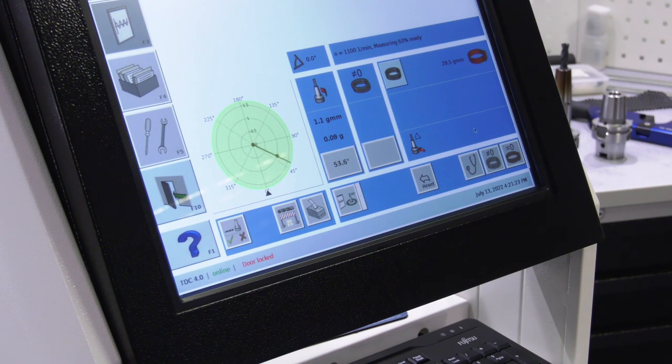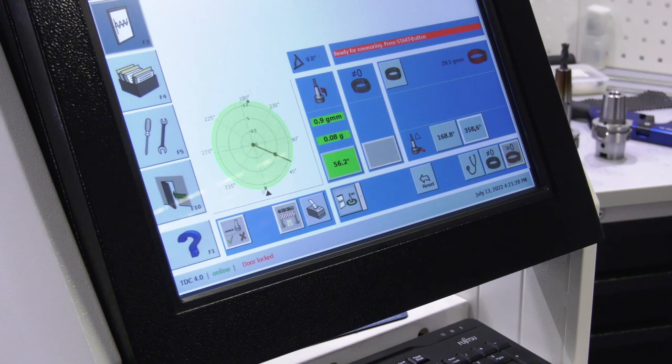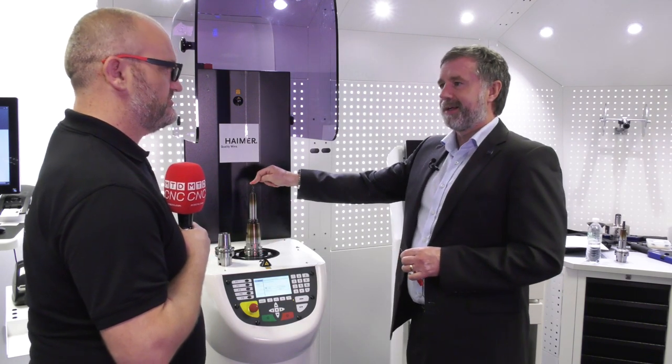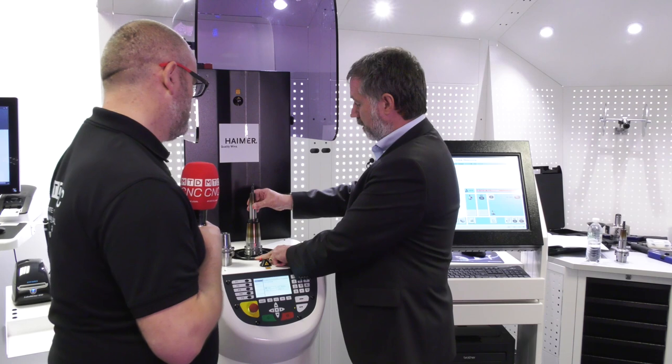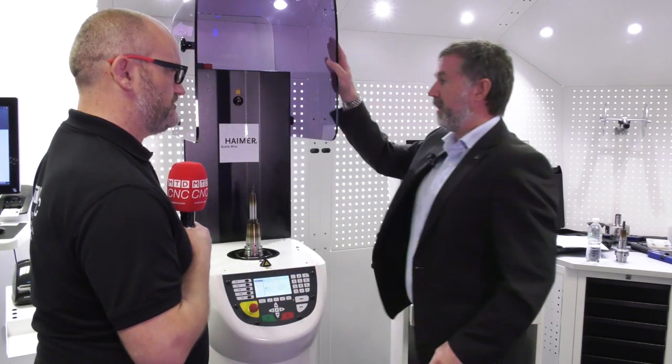So just while this is testing, what are the benefits? Benefits presumably longevity of cutting tools. Well, if you think, the tool holder is a durable piece of equipment. This should last forever, if you go through the heating and the shrinking process correctly. Yeah, to maximise this bit, which is a consumable. We're looking at removing all those negative variables. So we increase rigidity, we remove imbalance. You've just touched on it there, tool life, surface finish, machine accuracy, all these negative variables which come into the machining process. And spindle life on the actual machine tool itself, which are expensive, of course. Absolutely. Well, if you think of a medium cost machine, a new spindle could be anything between 20,000 and 45,000 pounds to replace, and then you consider the downtime when the machine's not working.